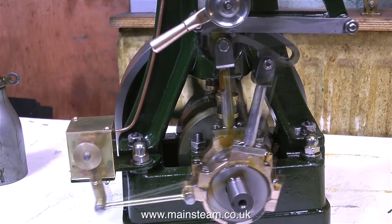Finally, once again, it's worth mentioning that it's not just a megaphone that makes it louder — it's the valve timing and the amount of load the engine is under. But a small megaphone on the end of the exhaust pipe will generally make most steam engines a good bit louder. Thanks for watching, and I hope you found this short video useful.